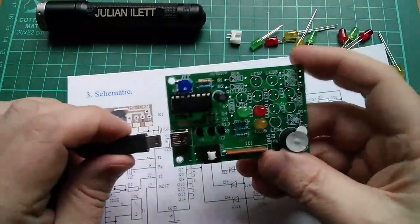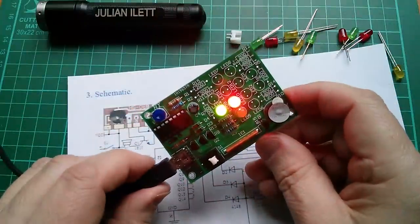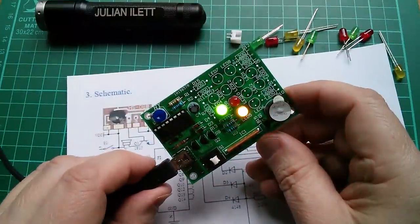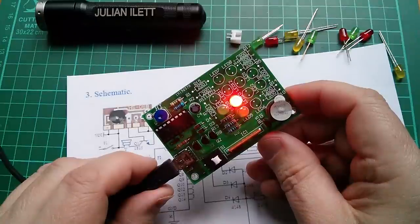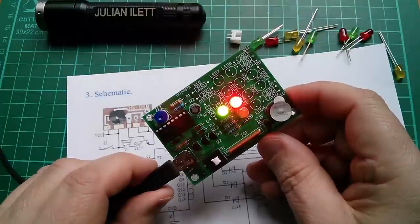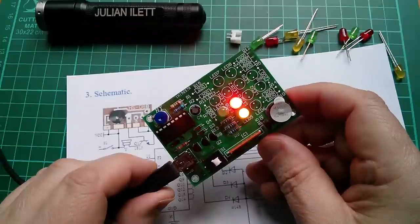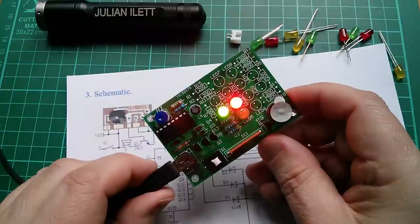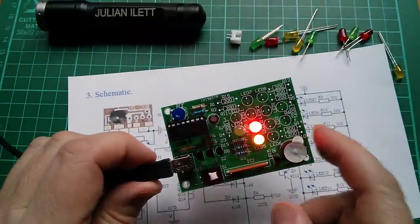The diodes are in — let's see what it does. 7, 6, 5, 4, 3, 2, 1, 7. It misses out the zero count, which means you're never in a position where you've got no LEDs on. That's very clever — that's the purpose of the three diodes: simply so that you're not left in the dark.